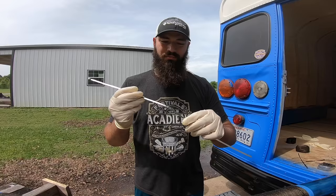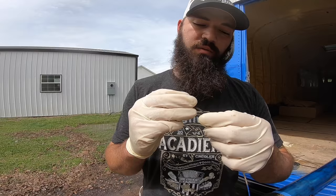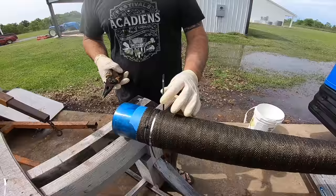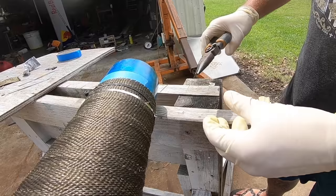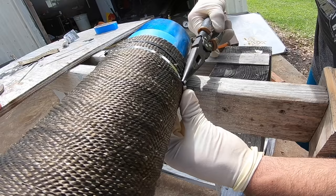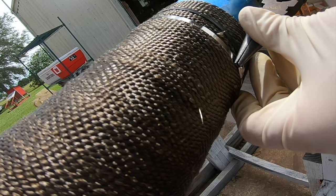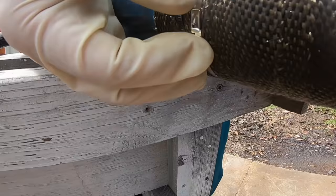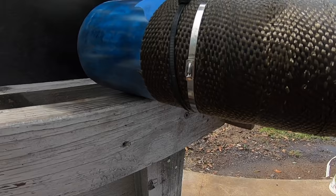These are the cable ties that come with it — they're stainless, real similar to a zip tie. But since this is a four-inch pipe, it's too large to do just one, so we're tying them together in a spot where it won't be seen. These are tricky — I wasted a lot of them. You want to roll it inwards and clamp it down, do that one or two times, then do the same on the opposite side and pull it a lot tighter. So that's not moving now — pushing up, pushing down, it's pretty tight. Then we cut the zip tie.